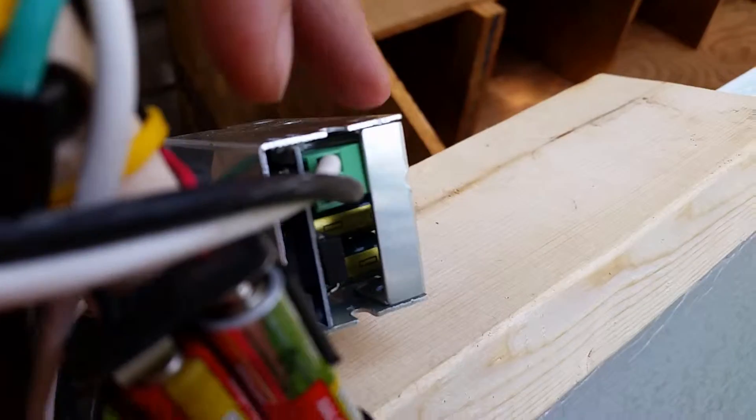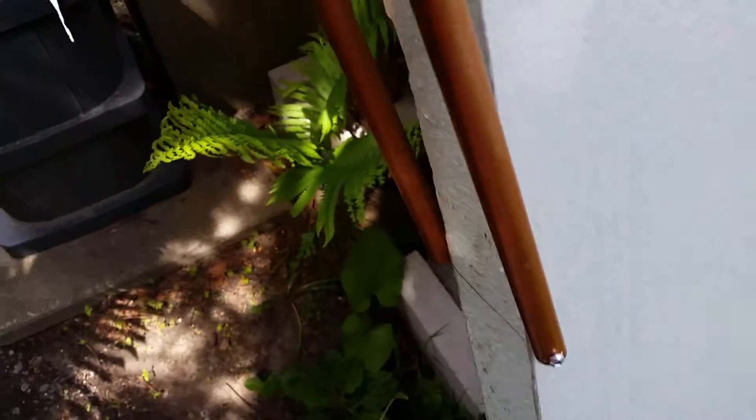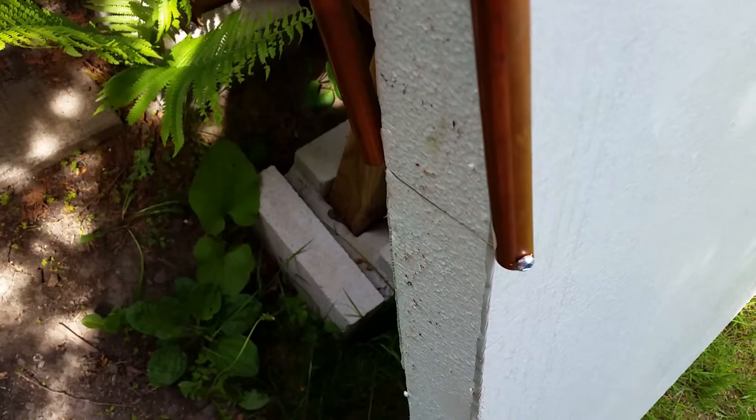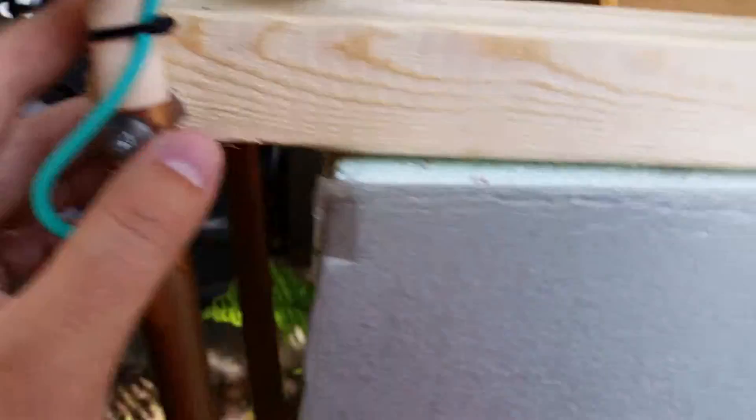This is adjustable so I can change the temperature. If it's too hot, the wire breaks. But if it's too cold, there's a lot of drag as you're moving it through the foam, and it pulls on the wire and does risk either snapping it or changing the height, so you end up with an uneven block — which is why it's important to tighten this.